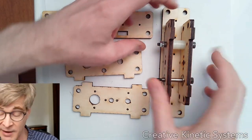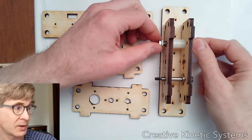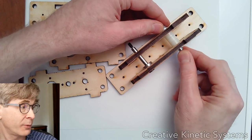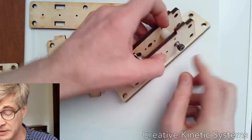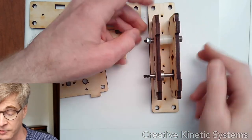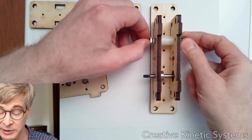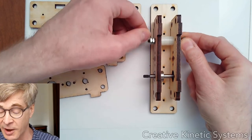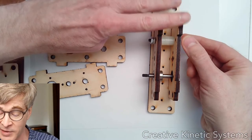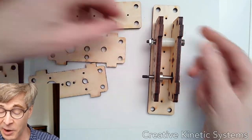Here's a different structure where I've press-fit the bushings into the smaller holes. It's a little more complete — I've used some washers to space out the interior. With this structure, the shaft can freely spin inside those bushings that are press-fit into the wood. You can see a little cylinder at the edge of each bushing pressed into the smaller holes. That is a way to build a nicely supported shaft, using the wooden structure to support the bushings at some spacing on a shoulder screw as a shaft. The washers and nuts are there to constrain the axial motion a little bit, and there's a lot of room for improvement, but it's a starting point.